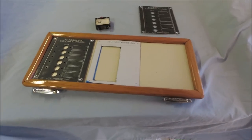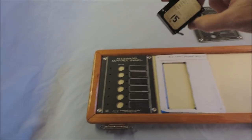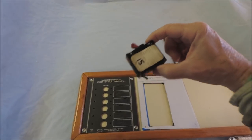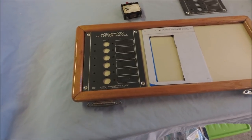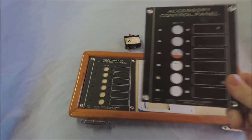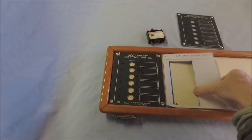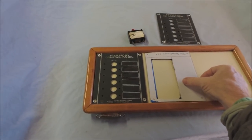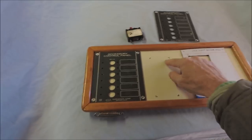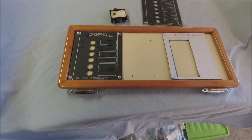This is going to be the 12 volt switch panel and we're using circuit breakers — standard size; this one's 15 amps and they come in different ratings. We're repurposing an old switch panel that I had to cut down to make fit. I made this pattern here for the cutouts for the switches, so we can mark here and then drill and cut those out so that the two switch panels will fit on there.